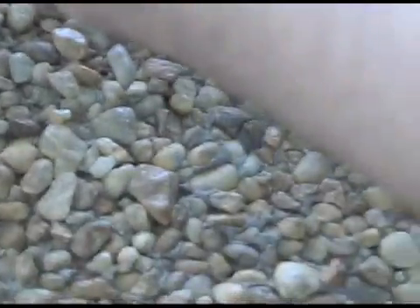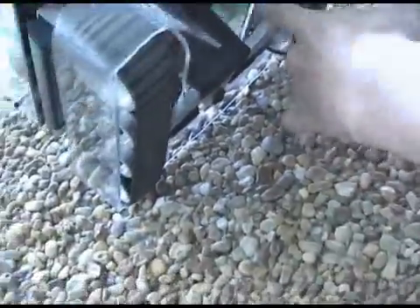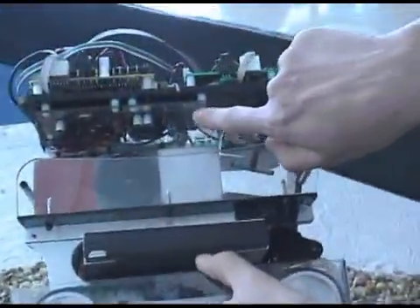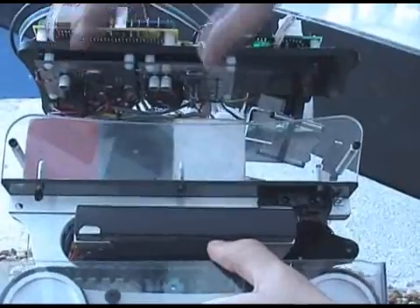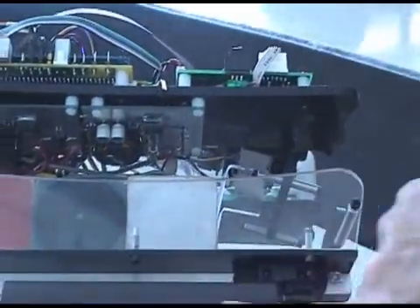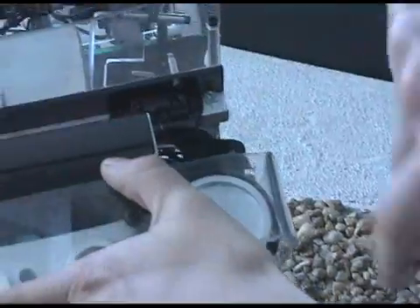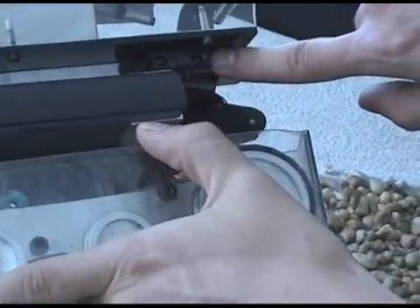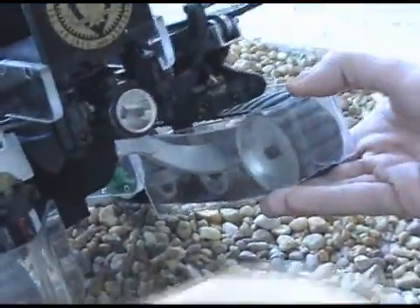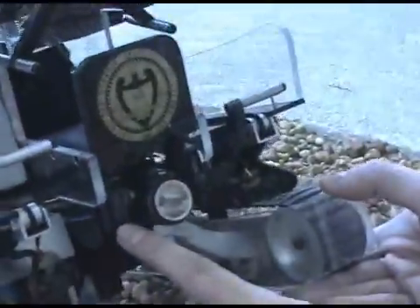This is an RFID reader — the coil is reading the RFID tags on the blocks when they go by. There's a photo interrupter that also triggers whenever a block goes through here. Our 5-volt switching regulators — one of them is for these servos, which need 5 volts, but our battery is 14 volts, so this steps it down. And these are the infrared range finders looking at the walls for wall avoidance. We've also got infrared sensors here and here to detect blocks, and more of them here to detect the wall in front of us.